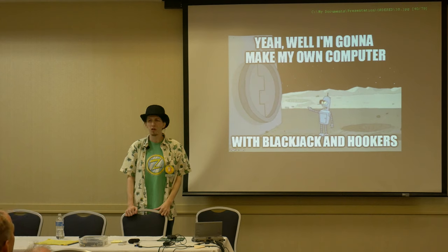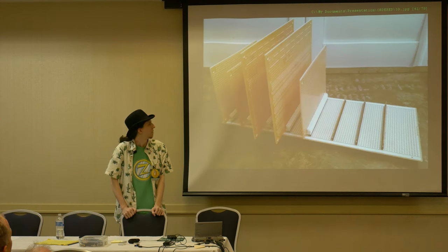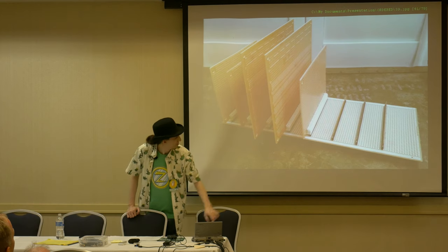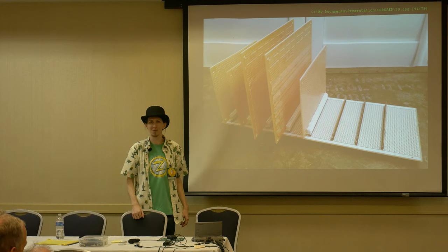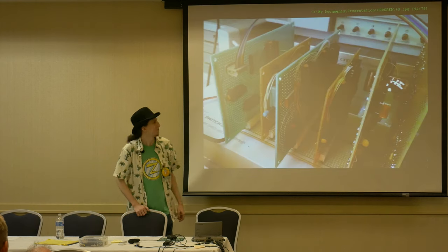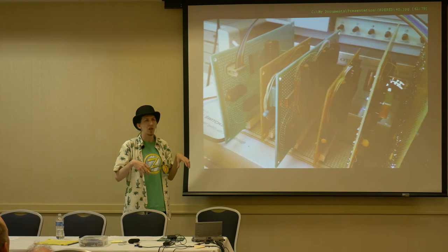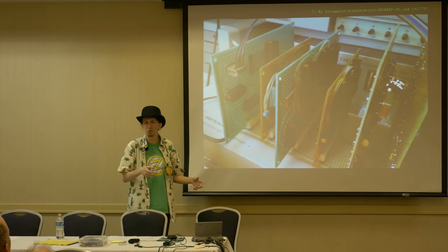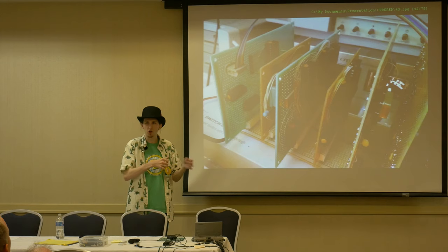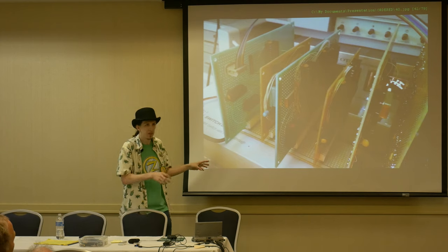I decided I want to combine some of these concepts and make my own machine. I start looking around finding parts, and the next thing I know I've got a crude bus. People ask why it's 35 pins wide — I found a board with 35 bus strips and said I bet I could fit a 6502 bus on there. Turns out yes and no — I already filled it up and now we're at 40, with only 35 pins and jumper wires. I wanted to experience this the way folks did in the 1970s using era-appropriate techniques. Wire wrap sockets were tough to find, so I went with point-to-point wiring — solder everything down, more durable, and you can pack the boards tighter. No pre-etched boards, just testing and building and modifying as I go.